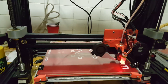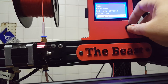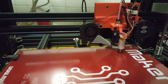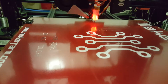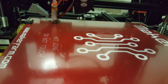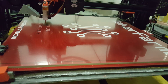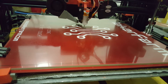I got the BL Touch working — fairly simple to use. Bed level: go to the back of the bed and start the calibration process. I've got it set up to touch the bed in nine different points. I need to adjust the travel; I was conservative on my X and Y axes to make sure the probe stayed within the limits of the bed. Right now it thinks it's a 225 by 225 millimeter bed and I need to measure how far out I can move it.